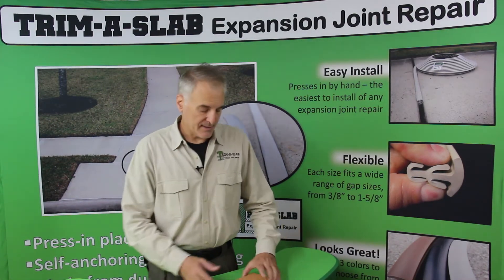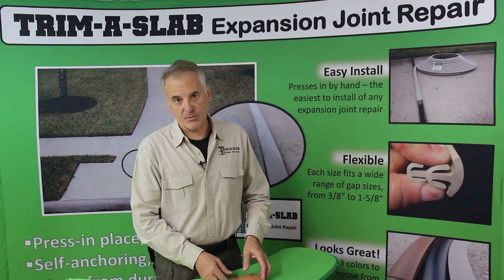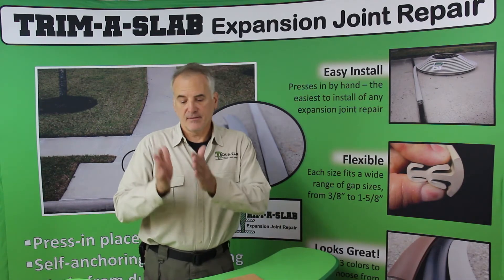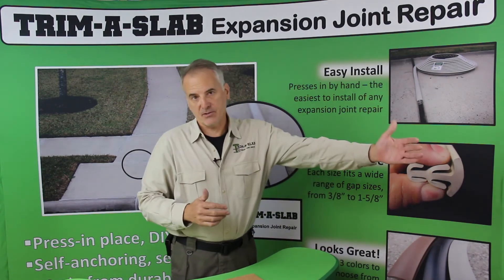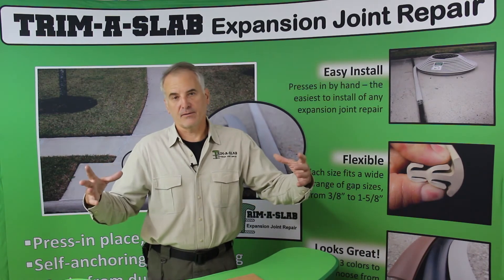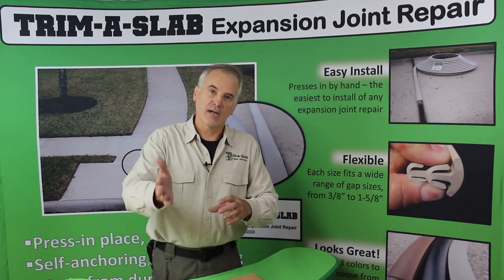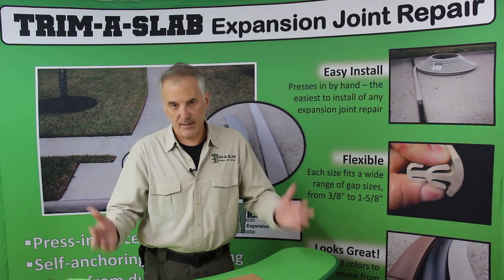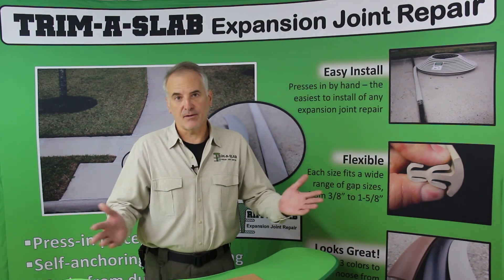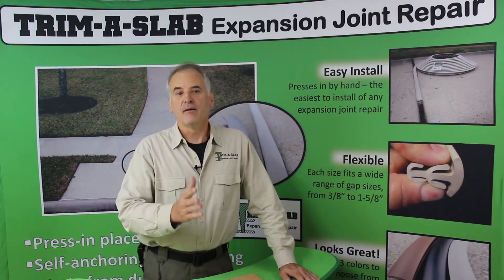The other type of joint you may run into is a control joint — not a complete break in the concrete with an expansion joint in between. You find those a lot on sidewalks as a groove. So you might see an expansion joint, then a groove, a groove, a groove, then an expansion joint. Those are called control joints and they're there because concrete is going to crack — so a groove is put in the surface where the concrete is thinner. When a crack does appear, it appears at the base of the groove and won't be very noticeable. Expansion joints are necessary for the integrity of your slab; control joints are really just to make any cracking less noticeable.